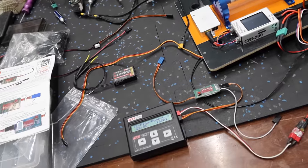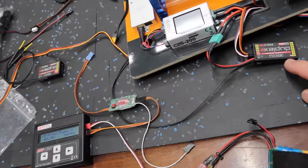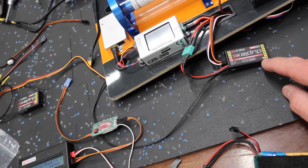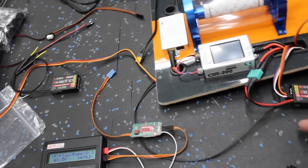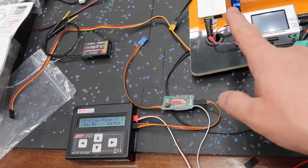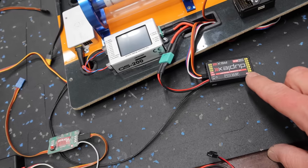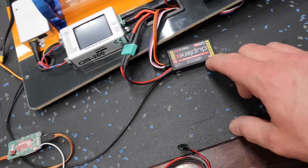All right, we're just trying to get everything organized here as far as layout goes. On a plane with a bunch of telemetry like this, our E ports or EX bus ports are quite valuable. So what we're gonna do here is I'm just kind of moving stuff around while I'm programming the V-Spec module for Jeti. Initially I had my gear bus wire coming to this receiver in the E2, but we're gonna change that around and have our turbine come to this, so E2.